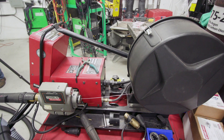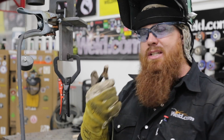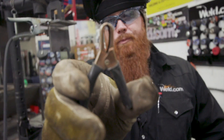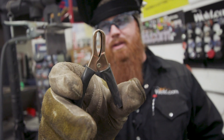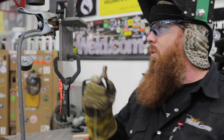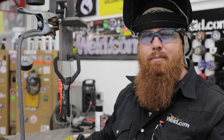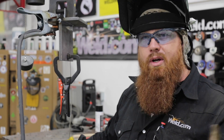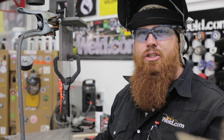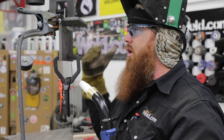Because we're using a power source with an external wire feed machine, we have to use a voltage sensing lead — a lot of you had questions about that clamp in the previous video. What it does is give the external wire feeder feedback, telling it exactly the output it's getting so it can regulate voltage, because pulse MIG welding is a constant voltage process. To maintain constant voltage, it has to have return information to ensure it's getting what it's putting out. We're going to use fume extraction again in the overhead position.